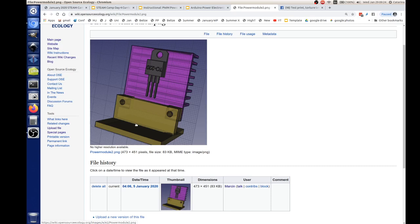So basically we're just getting the background on this. We can design these power electronic systems that are driven by Arduinos, because we give little pulses of signal to this power element to turn it on and off rapidly to control voltage. In a way such that you have something like a dimmer, for example. When you rapidly turn it on and off, depending on the duty cycle, in other words, how long it's on versus how long it's off, that will determine the power throughput. And we'll do that explicitly with a light bulb, showing that we turn the knob on our electronic circuit and make the light bulb go fully bright or down to zero.